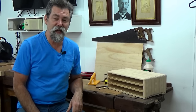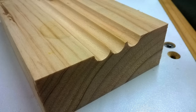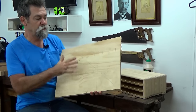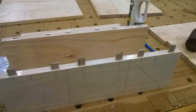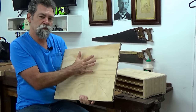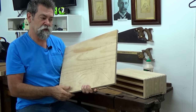This is the part a lot of people have been waiting for — making the actual cradles. I took some photos of my test cases where I tried using my core box bit across the grain or along the grain to see which gave the best result. Going along the grain was far superior. What I did was join three pieces of timber together and basically made a small tabletop. I put dominoes in these positions, drew it out so I knew where I was going. You can use dowels or biscuit joints, but make sure all of them are close to the bottom of the timber when joined — don't have them close to the top where all the slots are going, because you may expose them when you run the core box bit over.